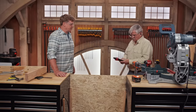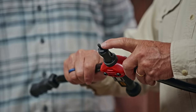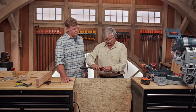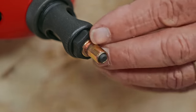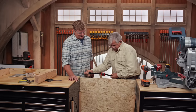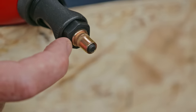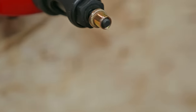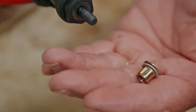What is this magical piece of equipment? It works just like a rivet gun. The only difference is that instead of a standard rivet, this is a threaded part — you screw the threaded insert rivet into it. You see the knurled part of the rivet head right there. When I pull this together, watch that compress. The metal of the cabinet will be between the front and that bulge that's happening? Exactly. That holds the rivet head, which is threaded on the inside, onto the cabinet.